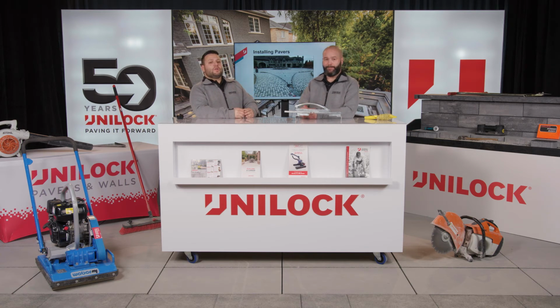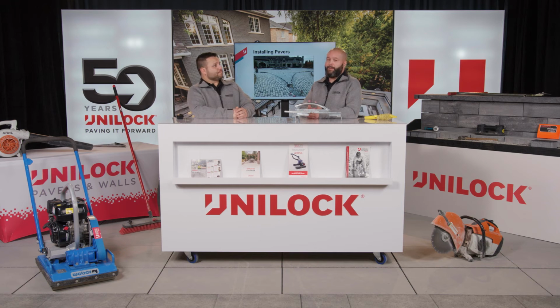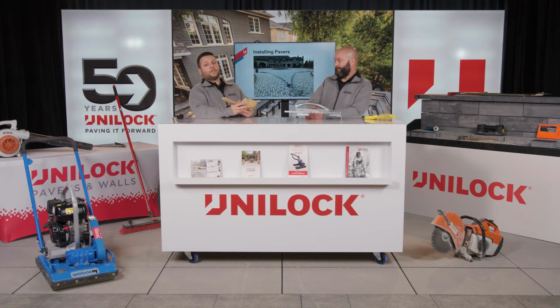Yeah. So Jay, at this point we're almost ready to get to the last phase, but before we go there, let's talk about some of the tools that might differ if we're placing wall stones versus just laying pavers. For sure. Building the base, a lot of that is in common with your pavers, but something you don't need to install pavers would be a caulking gun and concrete adhesive, because if you're doing small garden walls, you're going to want to glue course to course. Absolutely. Before you glue, you're going to want to make sure the surface, the top, between each course is really nice and clean. You don't want any pebbles or stone chip or dust in between.